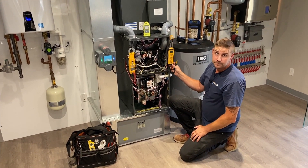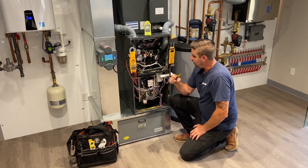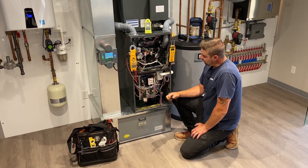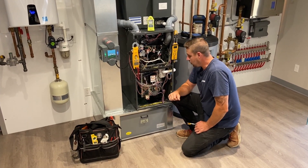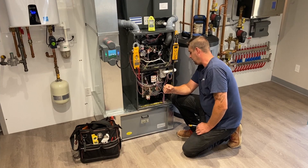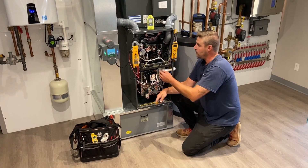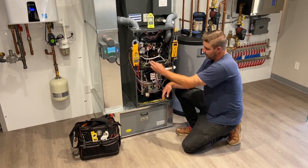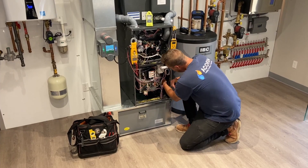There are lots of other things on here. As you can see, all this new equipment has multiple different safeties that some of the older stuff does not. We would also be amping your inducer assembly — testing what the motors are pulling — as well as your blower motor down here.